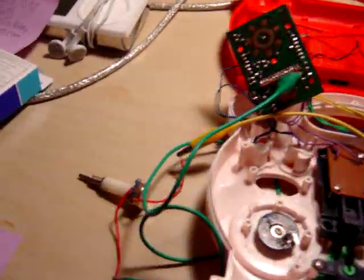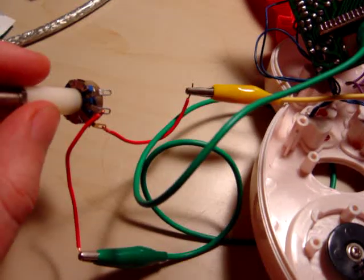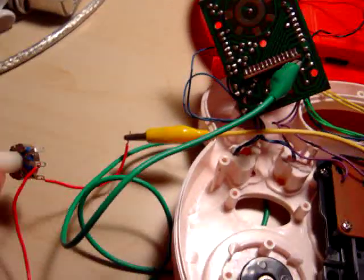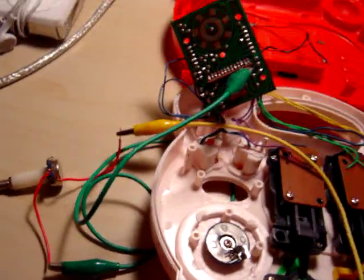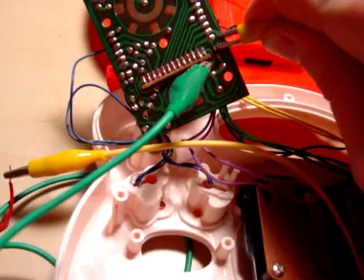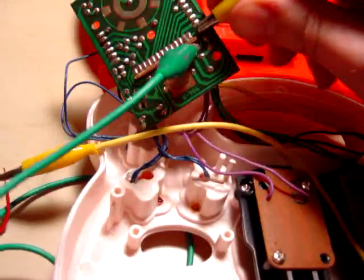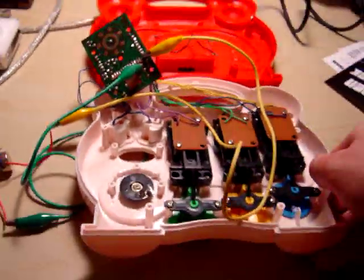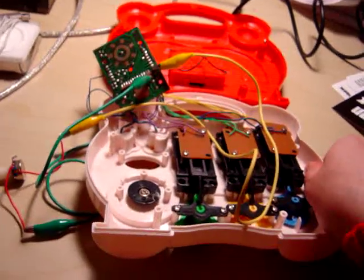The potentiometer is over here, and right now I've just attached two wires to it without any soldering, and connected it to the circuit board with alligator clips. I'm going to connect this alligator clip to what turns out to be ground, making sure that I'm not shorting it. Now if I press this tune again, you'll hear it change already just by having the potentiometer in the loop.